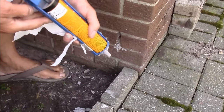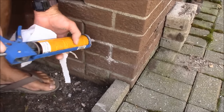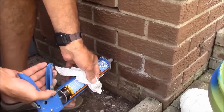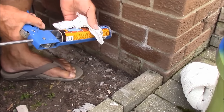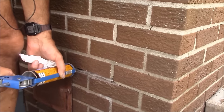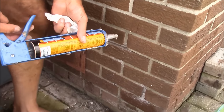That way I never get caulk on me — I'll use them once and discard them. See how I'm driving this into the crack. There's a nice release in the back of my gun. After I put a little in, I try not to get it on the brick — it's not going to come off very easily. I fill it until just up to the surface for joints that are pretty deep. I want some serious caulk in here; I want this to last a while. For this deep crack, I'm going to lay in one layer first, let it stiffen up, and come back and put a second one in. When it dries, it dries hard and bonds things together.